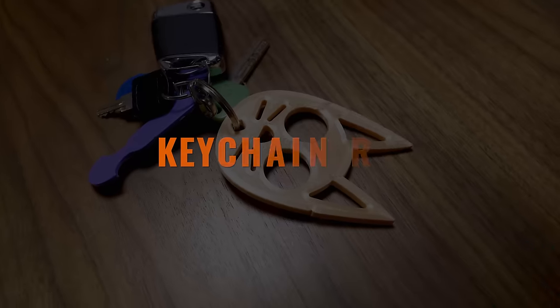When ordering, just make sure you select the right temperatures. I like to keep an array from 25 all the way up to 45 degrees Celsius, and also pay special attention to whether or not the switch will turn on at that temperature or off at that temperature.